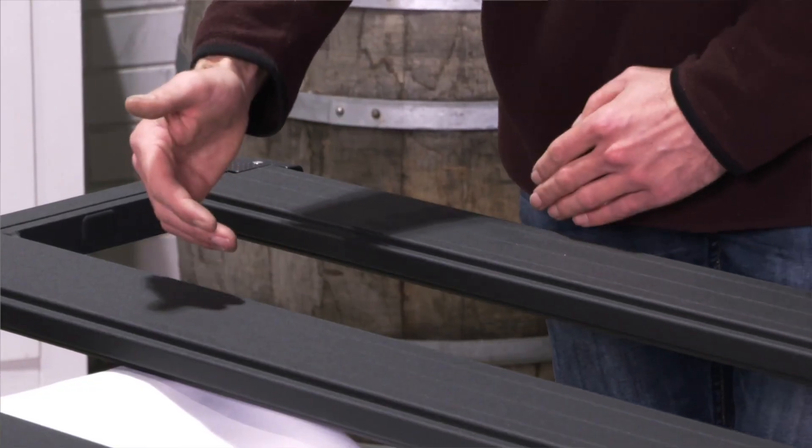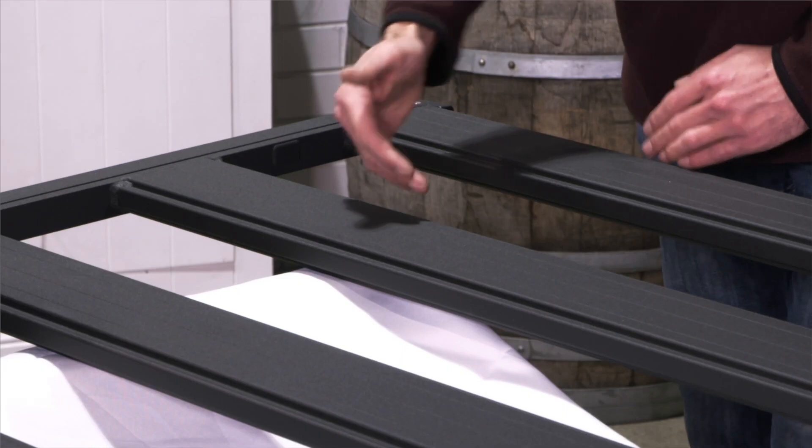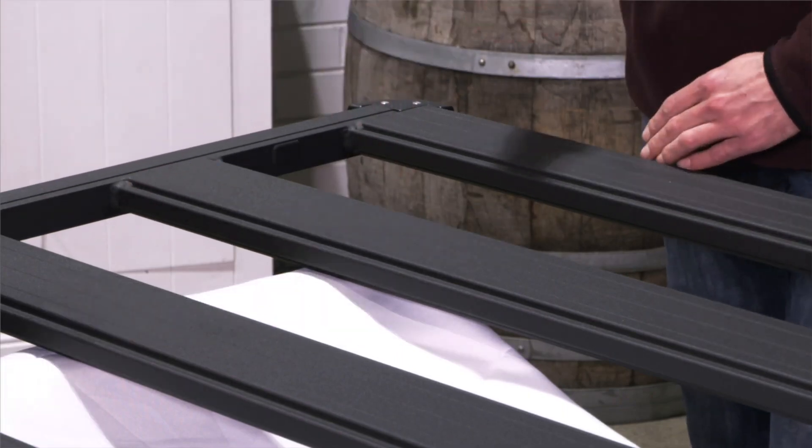A key part of the design and accessories is the constant pitch between the beams. Every time we make a new rack, we add a beam, so the cab racks will be five-beam, then six, seven, and eight — with 290mm added each time. This consistent pitch is fundamental to how the rack system and accessories work together.